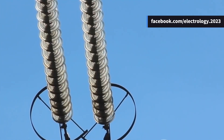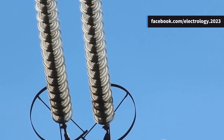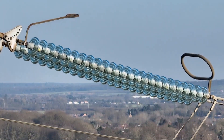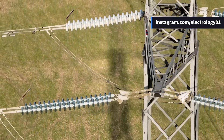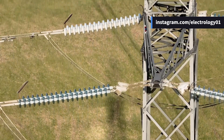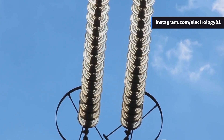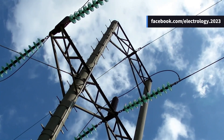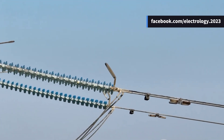To maintain proper electrical insulation between the conductors and the supports, we need insulators. Insulators are fixed to the supports, and the conductors are then attached to these insulators. They ensure that the high voltage does not leak to the metal structures of the towers or poles. These insulators are generally made of porcelain, glass, or polymer materials. You may have noticed the disc-like shapes hanging from transmission towers — those are disc insulators used in suspension-type fittings.